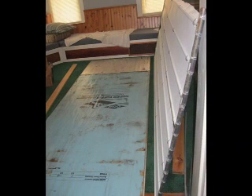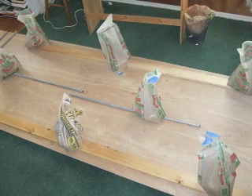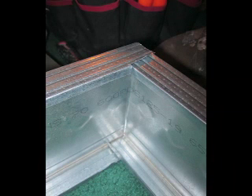Here is my insulation foam with Luan on top of it. I'm laminating Luan on top of that, and I'm painting it with anything I can find — it turned out to be blue. That's the bottom of the collector. And here I am making up the frame, which is made of 2x6 metal studding, and I'm bending it at the corners. It worked pretty well, though it's hard work — unless you're used to sheet metal work, this is a tough one.